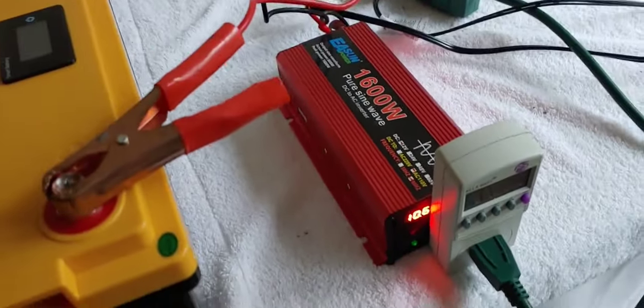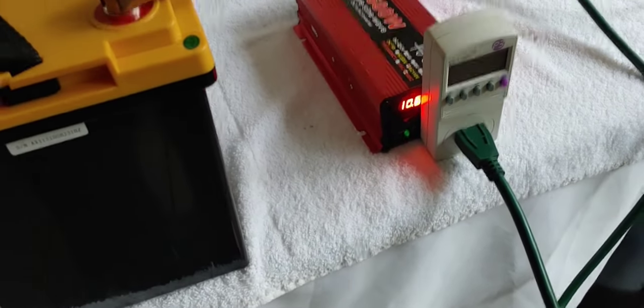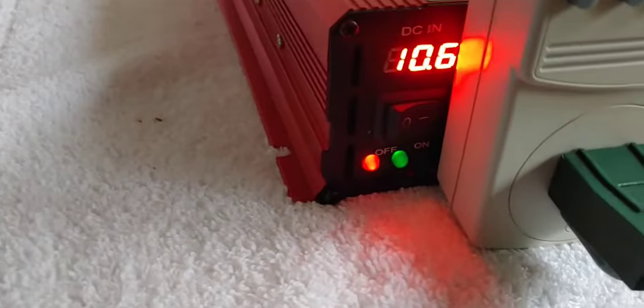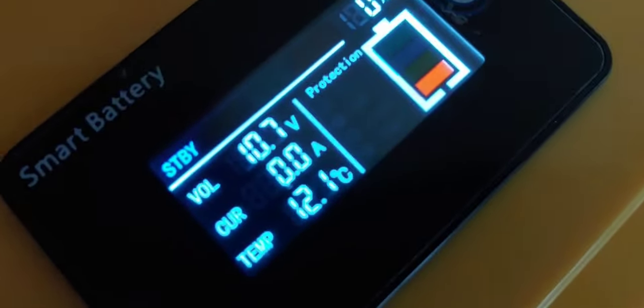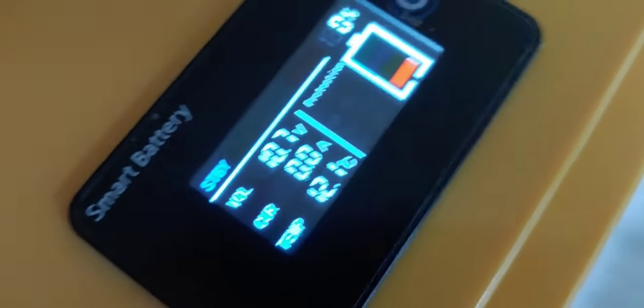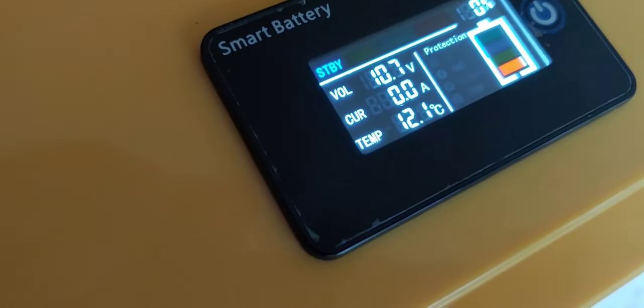It has gone 12 hours and 32 minutes, which means it went much farther than its rated capability says it should — so that's really good. The battery passed the computer test and it passed our real-world test. The inverter had stopped it at 10.6V. The monitor on top says 10.7V, so that's very good too. We're down at the bottom of capability with just a little orange line left — there's still a little in there, but probably not very much. This monitor from my testing is accurate in telling you the battery voltage.